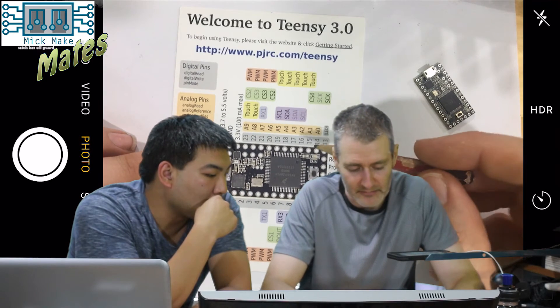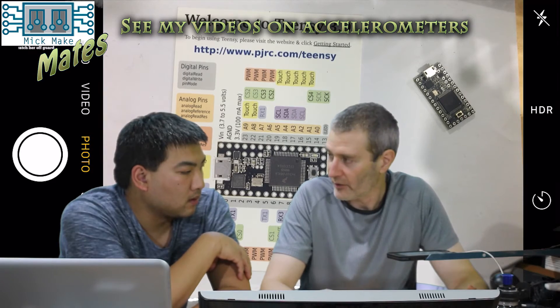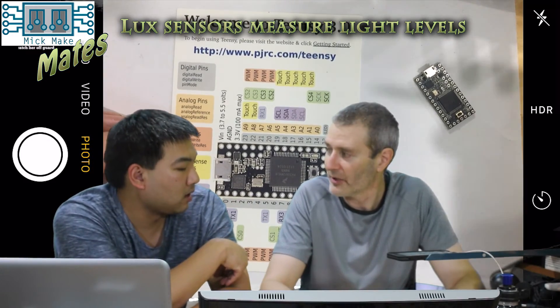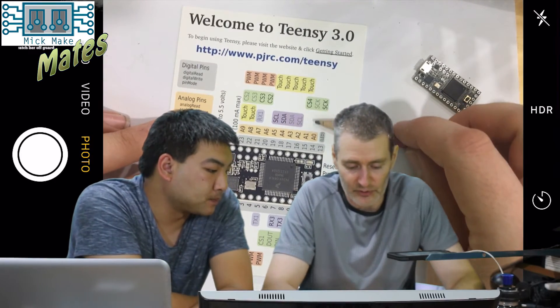The A's are the analog pins — these allow an analog input. If you've got an accelerometer and you want to read values from it, you'd plug it into one of these analog pins. Or like the daytime detectors inside motion-detecting lights — there's a light-dependent resistor, which is an analog signal. A lux sensor — you'd plug it into one of those. So you can see a lot of these pins have multiple capabilities.